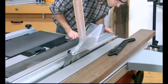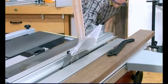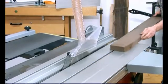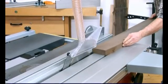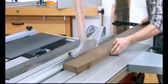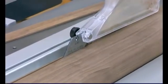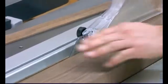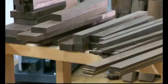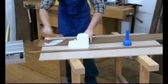As Helmut wants to cover the bottom of the runners with a layer of wood, he needs to cut 4mm strips on the saw. When making cuts that are close to the saw blade, it is best to lay the rip fence on its side. This allows you to leave the extraction hood on, helping you to keep your workshop clean. With the quality and precision of the Hammer C331, it was incredibly simple to make all of the pieces of the rocking chair accurate to the millimetre.